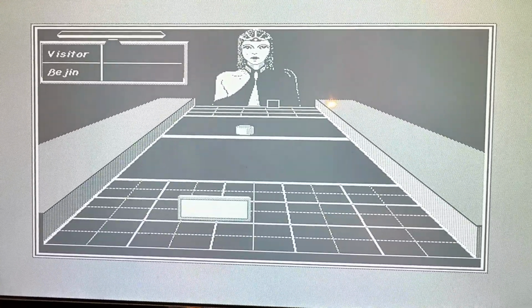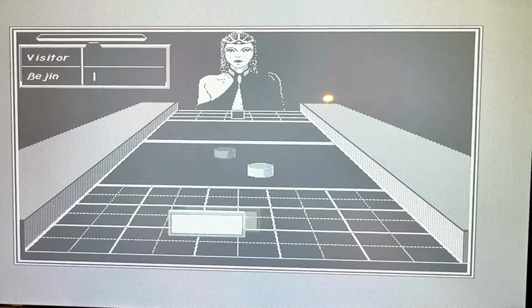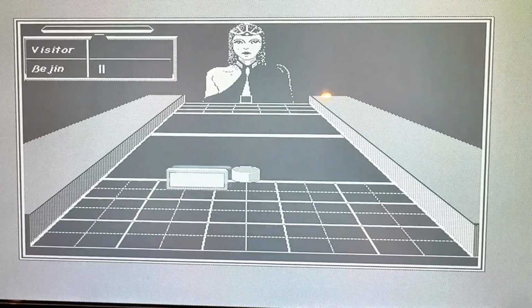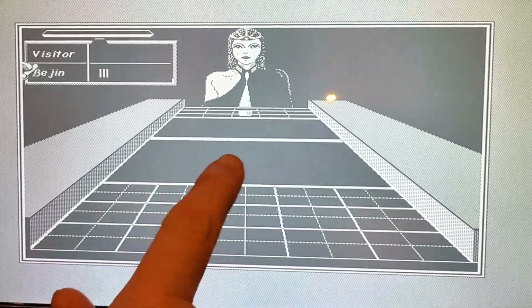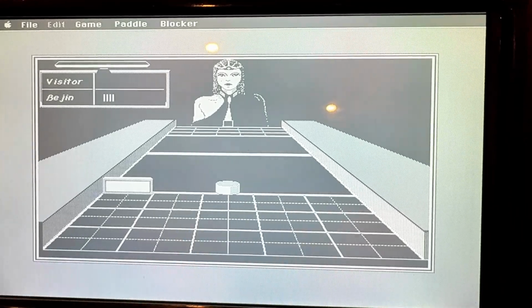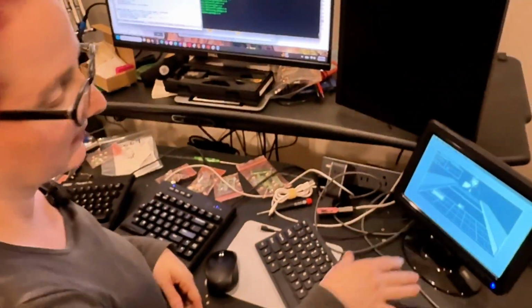One thing that's a problem is the mouse support is a little flaky. The mouse does work, but you can't move very quickly. We have to increase the speed of the IRQs for the mouse reads. But it does work. We just have to improve the quality of it. Another thing you'll notice is this is a dark gray, not actual black. That's because of the way the HSTX peripheral expands the 1-bit buffer into 32 bits or 24 bits or 16 bits. So we can probably fix that.